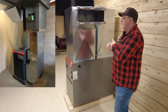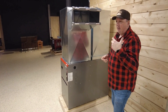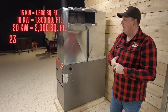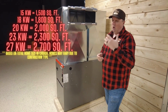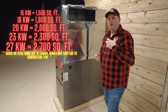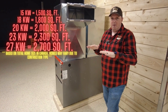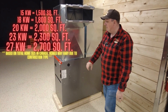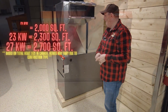You do need a 200 amp service for these — something to keep in mind. They're usually 15, 18, 20, or 23 kilowatts. Different models and brands will have 25 kilowatt options, and you might find something over 27, but it's rare. Once you get over a certain wattage you need more than 200 amp service, but 200 amp is the bare minimum — a must.